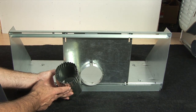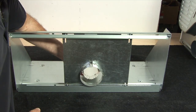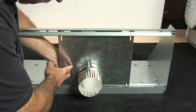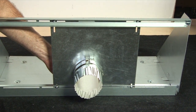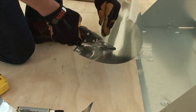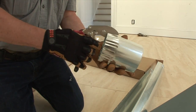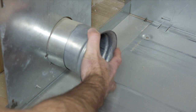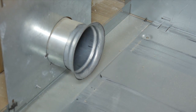Now create your connecting sleeve from heavy metal duct to insert through the adjustable back panel's clamp. The size of the connecting sleeve is determined by the distance between the dryer's exit vent and your wall connection. We recommend a 4 to 10 inch piece that fits tightly for permanent installation. Temporarily attach the blind lead into your connecting sleeve to assure proper measurement.